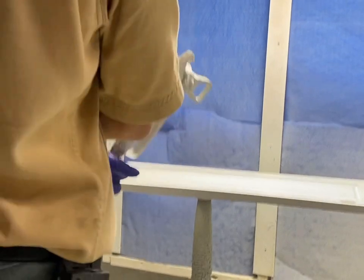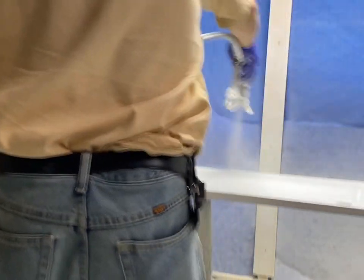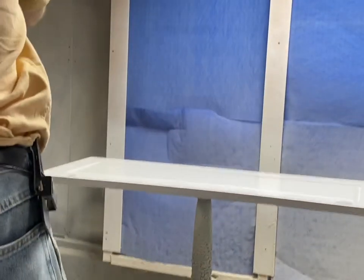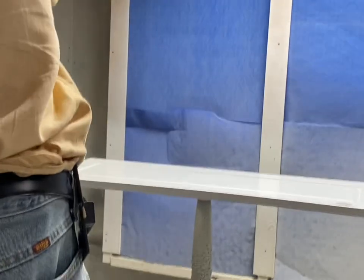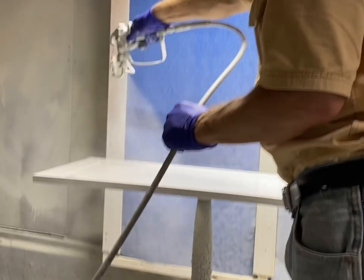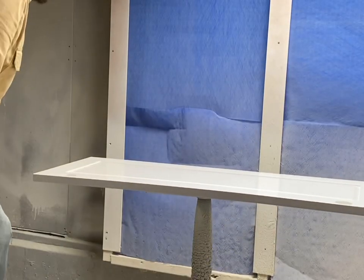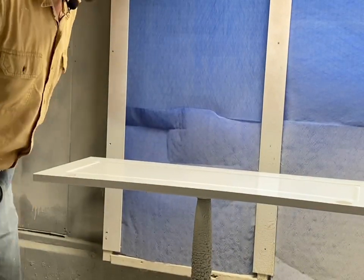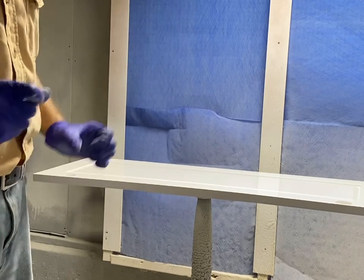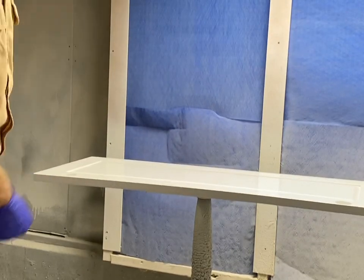About that speed. Now I go to my back edge, coming over about three inches at a time, and one final pass there. Then the same thing, just a little lighter. I take a look at this in the light and it looks nice and uniform. If it wouldn't be uniform, you'd see spots where there are little holes where the paint isn't flowing together well. If you see anything like that, just take your gun and give it another pass.